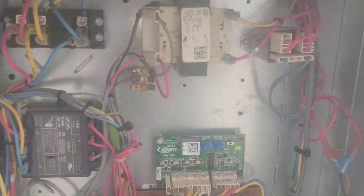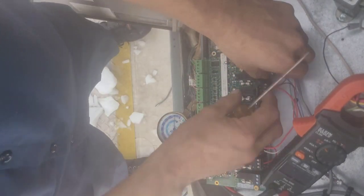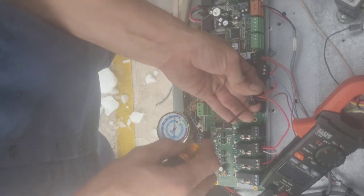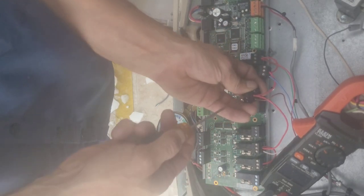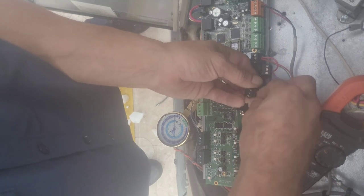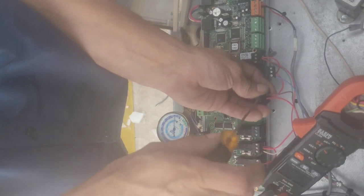For compressor two I'm going to want to energize that — it's going to be circuit two, Y2, I believe the brown one. So for my testing and diagnostic purposes only, I'm going to move the Y2 feed wire, the supply wire, over to the normally closed side, so that as soon as I plug this in it should energize my compressor — or there might be a little time delay, but it won't be that bad.